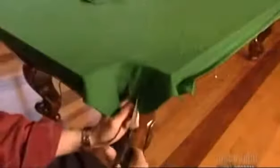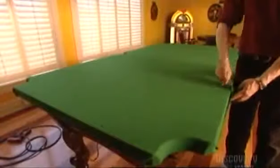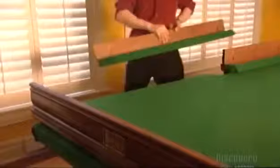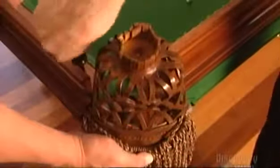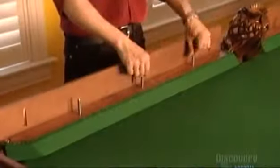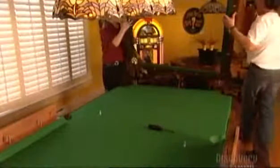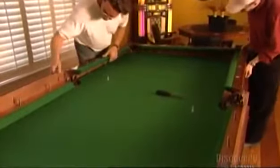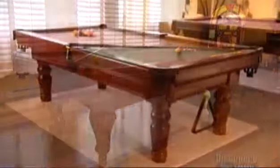After the wax dries, they cover the table surface with cloth in a variety of colors, cutting the corners to avoid creases in the pocket holes, then stapling the cloth to wood strips under the slate. A worker pierces the cloth over the slate holes. The six pockets are 15 cm deep, consisting of a metal frame covered with a leather lattice. Workers install 18 threaded metal rods underneath the rails, then insert them through pre-made holes in the table top. Screws attach the pockets, and the table is ready. For prices ranging between $1,500 and $15,000, you have quite a stylish game.